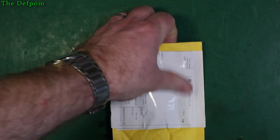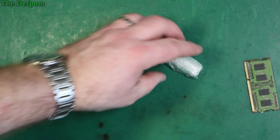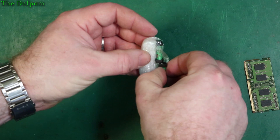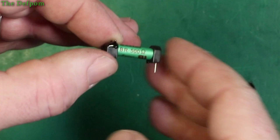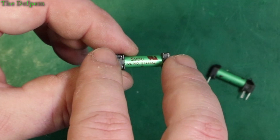What's this one? Some more reed relays — different package type. It's a typical barrel type, a bit more commonly used in test gear from time to time. So here we go — 500-ohm coil resistance. BE-star — single pin at each end. So those two are probably the relay itself, the reed, and those two are likely the coil. 5-volt DC. So a pair of those — just stocking up bits and pieces.